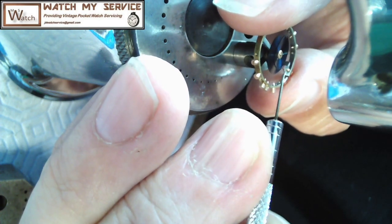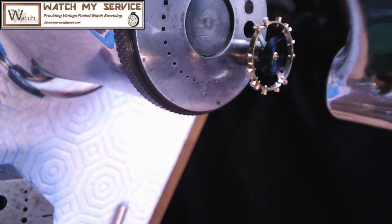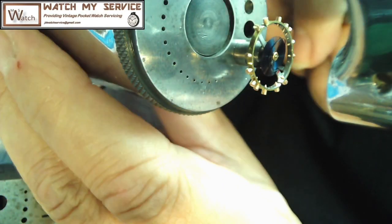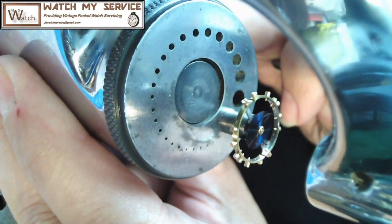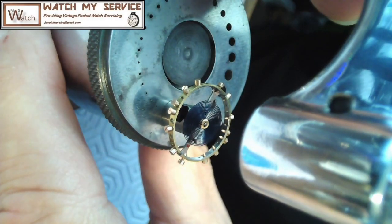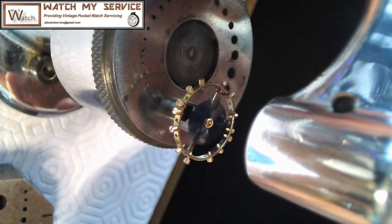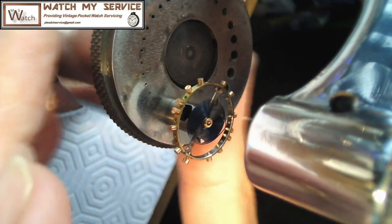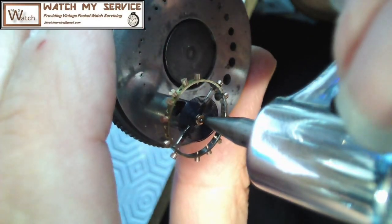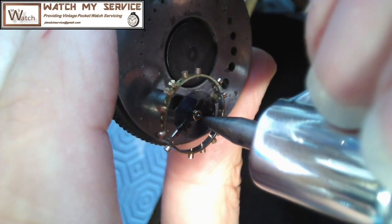I played with it there until I got it right on top and then I was ready to stake it on. I can use the exact same stake again to put this on, as long as it covers the majority of the collet for the hairspring - because I don't want to put stress on the collet or widen it. I just want to push straight down. A lot of times you can just use your finger to push down using pressure. In this case I tapped it ever so slightly down into position.